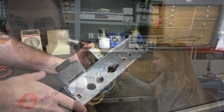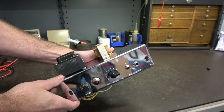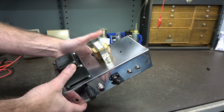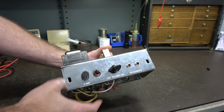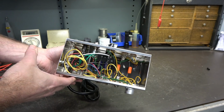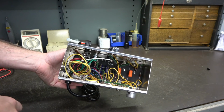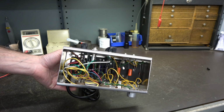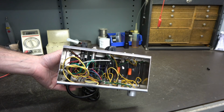Alright. So here it is. I'll give you a quick overview. The little 5F1 chassis, power transformer. This is the output transformer. It only has a volume knob, fuse holders up front, just like you'd see on the vintage amp. Built point to point on an eyelet board. Right? And this jobber is dead at this point, from what I hear. But we are not going to power it up until we give it an inspection.